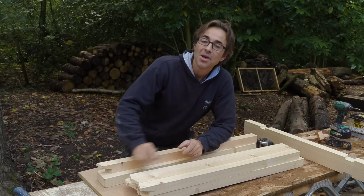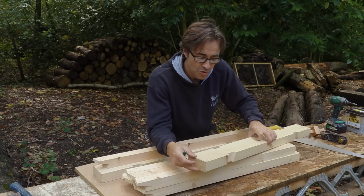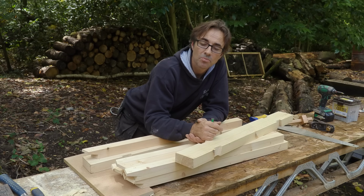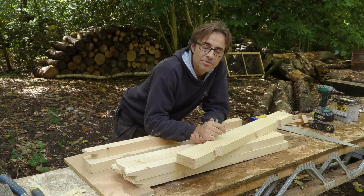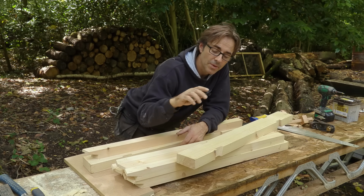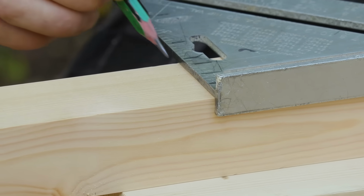And in tradition, what we used to do with our single bevel trestles was make sure that they were at the right height, that if you wanted to, you could put a notch in the end of them, and you can stand a door in the end and it keeps it upright while you're putting your hinges on, etc. So it's really useful for hanging doors. And the most common doors we use are 2'3" wide and 2'6" wide. And so I like to get my stool, so when it's standing, a 2'3" door will be just above it, so I can take a plane through and plane the door edge off.